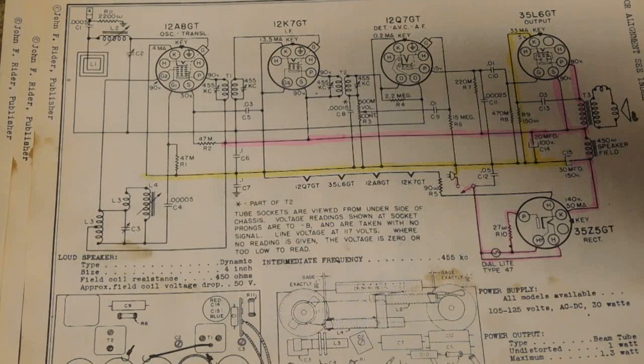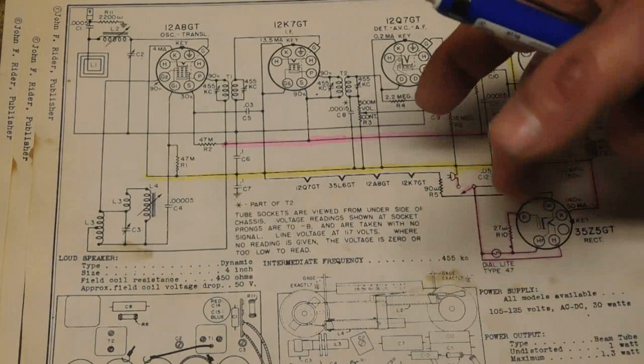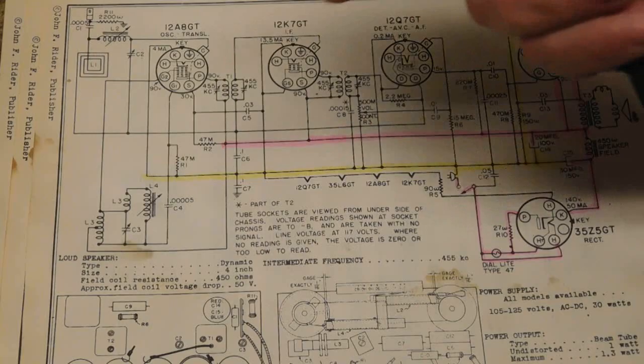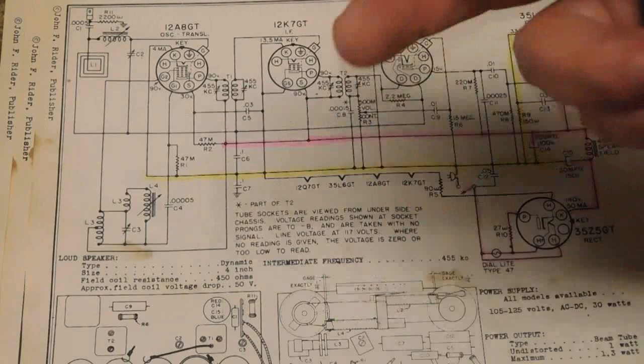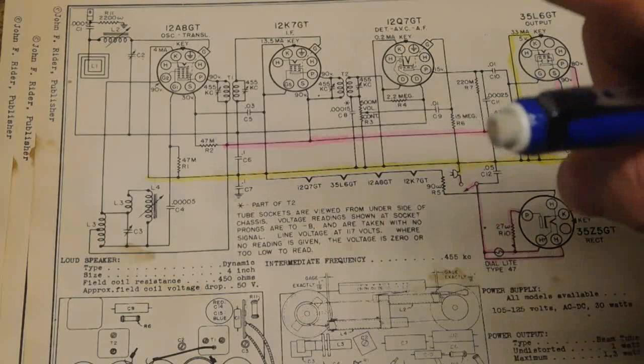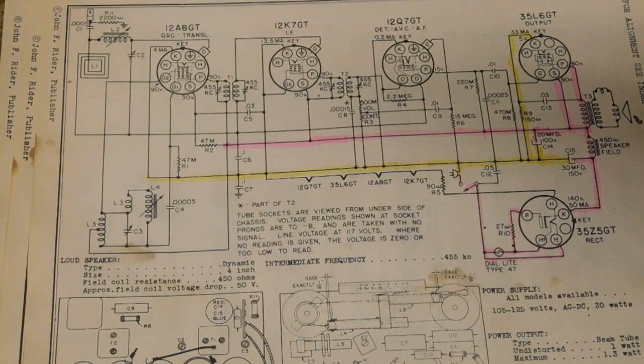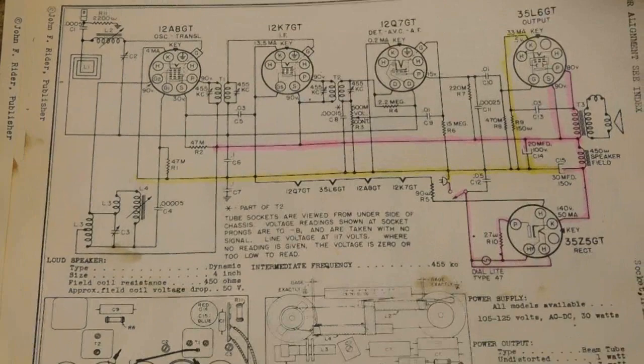Or it's a capacitor like in some of the newer radios, where they quit using so many cans and started using a large cardboard tube with the capacitor in it, and you'd have three or four wires, depending on how many sections it is, coming out in different colors. The black wire will usually be the ground, and it's labeled on the side of the capacitor. It'll say, like, the red wire is one of the sections, positive. Yellow, I think, was the other color, and then black was ground. So I hope I'm explaining this well enough to clear up the different grounds.